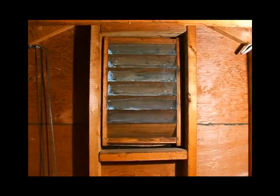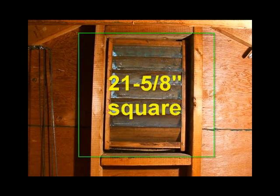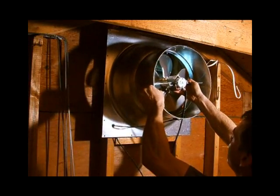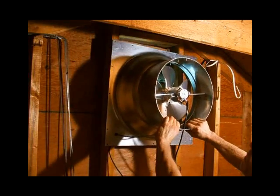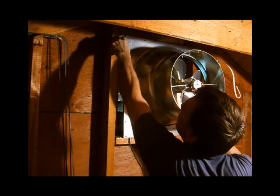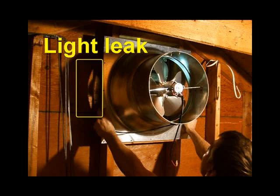With the bathroom vent ducting out of the way, the next step is checking the fit of the gable fan housing. The housing should meet the end wall framing so that the air stream from the fan will be directed out the vent hole without any air leakage. The fan housings were designed to work in a variety of situations from 16 to 24-inch stud centers. In this case, the fit was not perfect, so I had some extra work to do. The fan housing wasn't quite tall enough to span the space between cross members, and even with the fan housing centered between the studs, it was a bit too wide — you can see this because of the light leak coming through the circular opening of the housing.